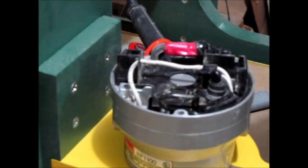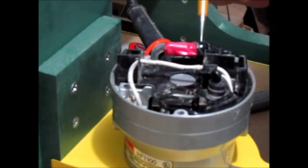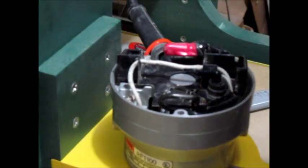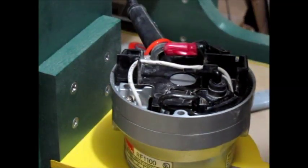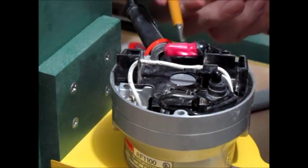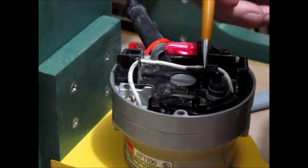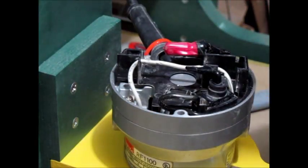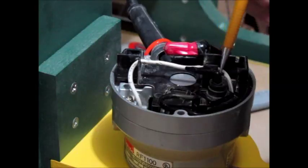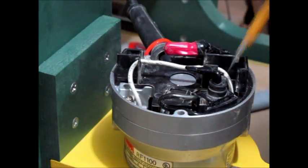Okay, well, it's back together. What I did was I hooked white to black, just took a wire nut and some electrical insulation tape and taped it together temporarily for the moment. This will be step one in preparation for installing my Super PID, of which I do not have everything around for. So this is only temporary. I snipped the extra little white wire off of the line, and again, that is just simply insulated with a piece of electrical tape, double wrapped. It should be fine. It's all in plastic over here, so I don't see it coming into contact with any metal parts. And of course the switch. Let's put it together.